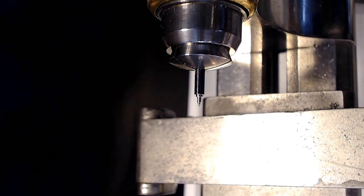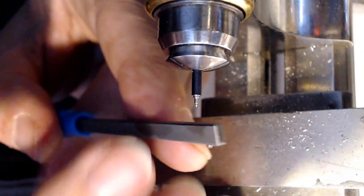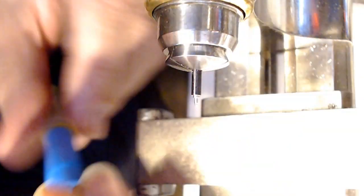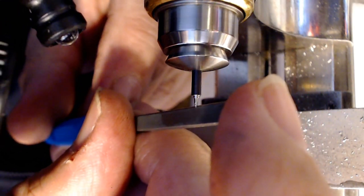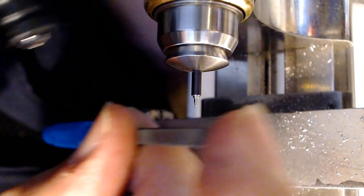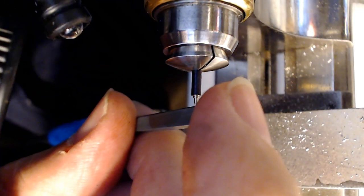So I just haven't made a balance staff in, like, what has it been? 2 weeks. So let me have a look at this. Take the plastic off the end because the less weight on that the better. And then I just want to be able to take some material off of this thing. I'm going to use the end parts. Like I said before, it's smooth surface here and then rough on the edge, so it should work on the pivot and not on the cone part.